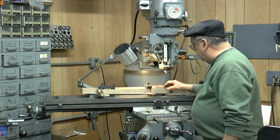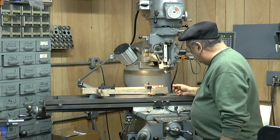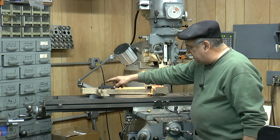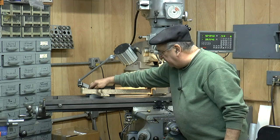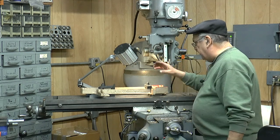You have to turn it over and do the bottom here to a size. That'll be done in a vise, probably. And then this piece here — while I start everything off the table, I got to flip it around, and I got to do the two pads and the one pad for the drawbar pocket piece, which is going to come off the old cradle.